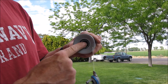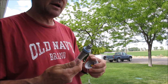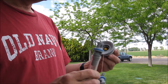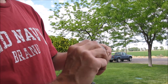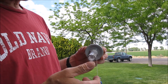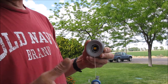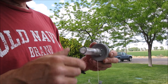If you push that valve in and twist it, and then hook up the adapter — this is the adapter right here, this is what fits on there — when you hook up the adapter, it has slots in it and there are pegs right there. The slots and the pegs fit together, and when they fit together you turn it and it's locked. Now you can go ahead and pump up your boat. When you get the boat pumped up pretty much to full pressure, you take off the adapter real fast and turn the valve and it will seal the air. Then you can put the valve adapter back on, give it a few more pumps, and it's done.